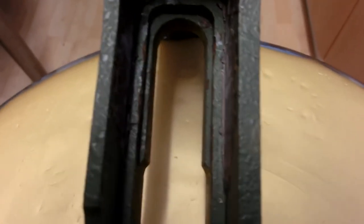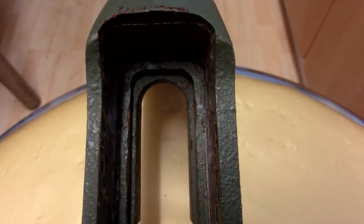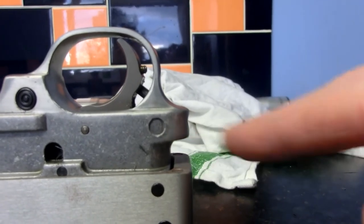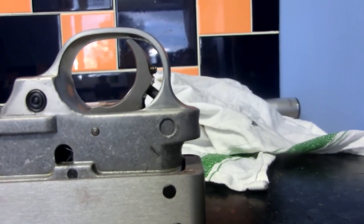Well, I had a bit of an issue in here whereby the bedding on this shelf made, this is really hard to see, made the gap down there too tall for this gap here, and I couldn't actually get the barreled action to slide back enough in the stock. But that was resolved simply by removing the vertical bedding from both ends, obviously, otherwise the rifle will tip up, and leaving the side and rear bedding in.